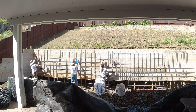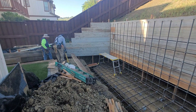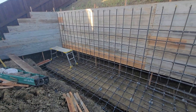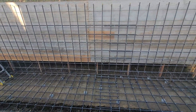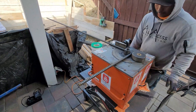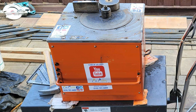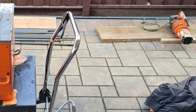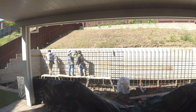This footing was about 60 feet long, 7.5 feet wide, 24 inches thick. We used number 6 rebar, 10 inches on center, and we also have a small keyway towards the front, about one by one. Detail is important when it comes to rebar — the inspector will get you. Having the right tools is essential, such as this rebar bender and rebar cutter. The bender bends up to number 7 and the cutter cuts up to number 8, so you definitely want those in your arsenal when building retaining walls.